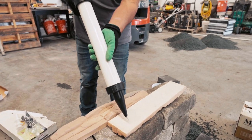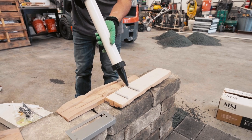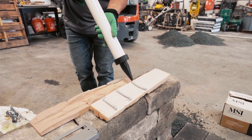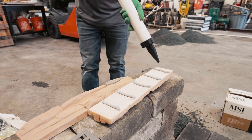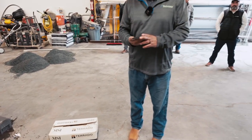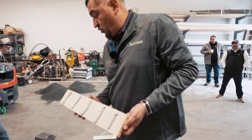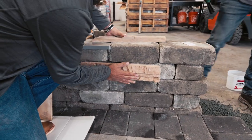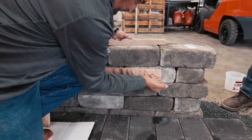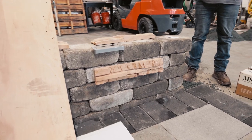Apply every four inches. This can be adhered to any dry surface — metal, wood, concrete, even drywall inside. The caveat with drywall is that if you pull it, it'll rip the paper off. Whatever it sticks to is only as strong as the substrate it adheres to. Now we've got a bigger piece — stick it right here. Didn't move. Done. That's amazing — that shows the grabbing power of this product.